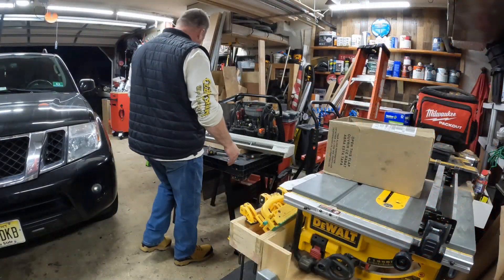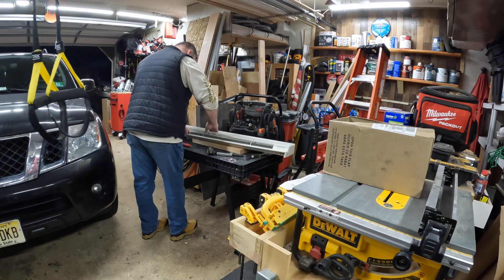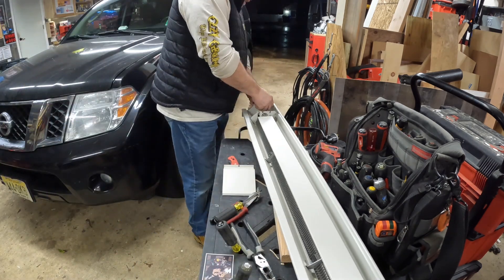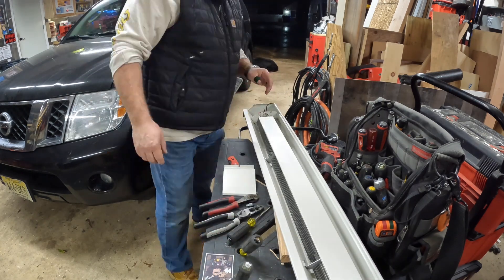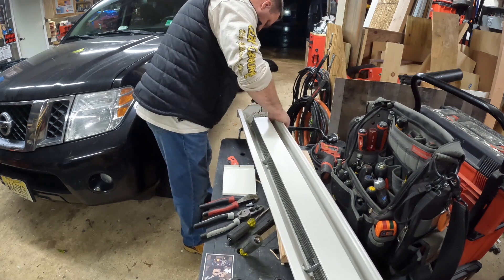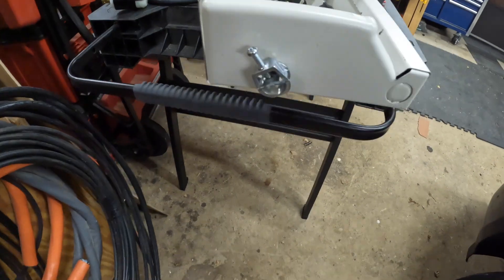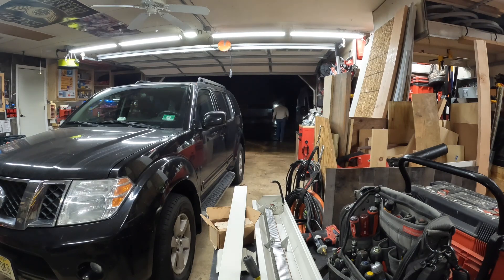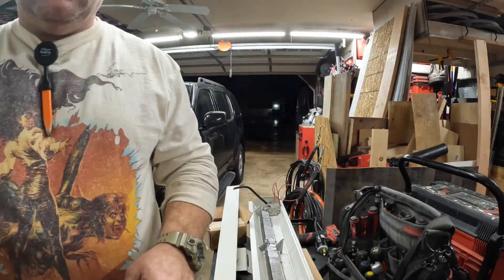The first thing I want to do is assemble the cord that attaches to the baseboard heater, and I'm doing that here in my garage in the upright standing position because it's a lot easier than doing it on the floor. Any work I don't have to do while on my knees or laying down, I'll do out here standing up. I'm using what's known as an MC and NM connector, half inch, with a concentric knockout — the half-inch hole is already provided.